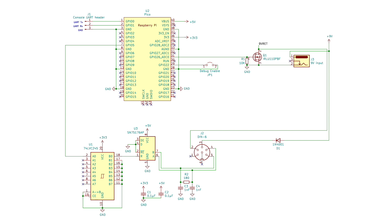The adapter has three power rails. There is a 9-volt power rail provided by an external power supply, and that's used to provide power to the keyboard, which draws a little over 300 milliamps on its own and has its own 5-volt regulator on board. There's a 5-volt rail provided by the USB connection to the host, and there's a 3.3-volt rail which is provided by a regulator on board the Pico. There's a small power MOSFET on the low side of the 9-volt rail, connected to one of the Pico's GPIO pins.